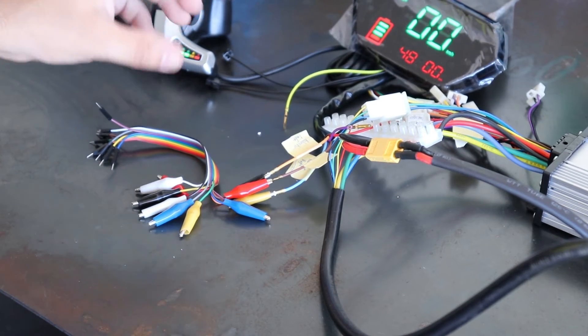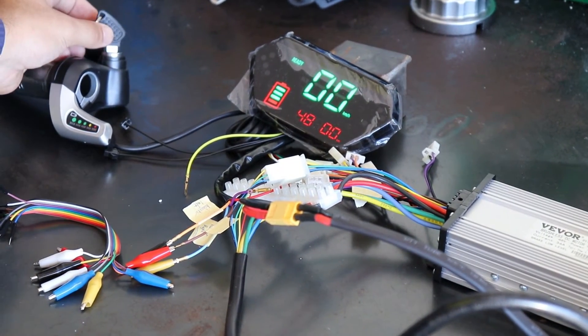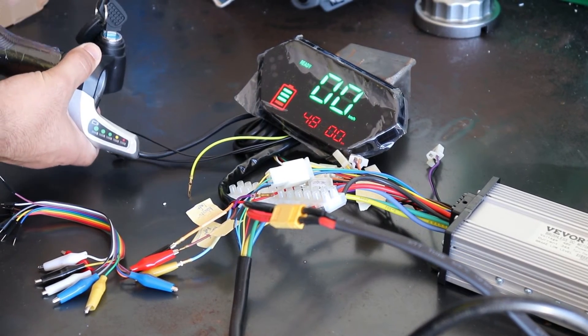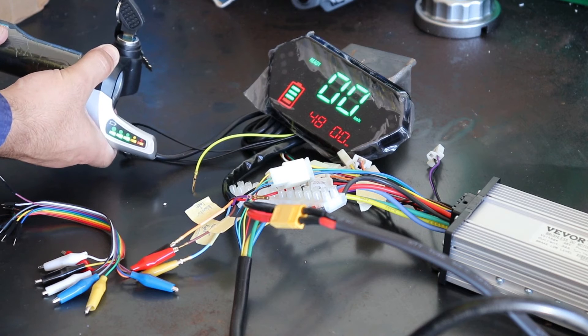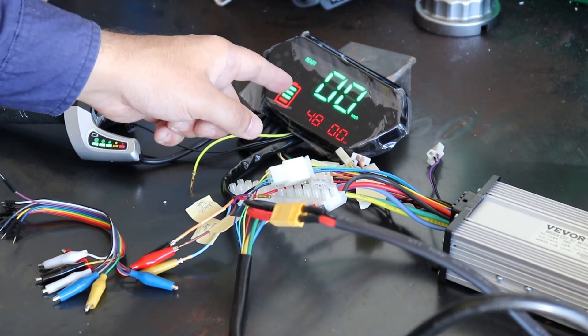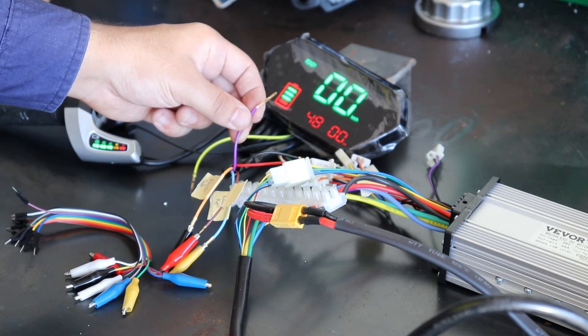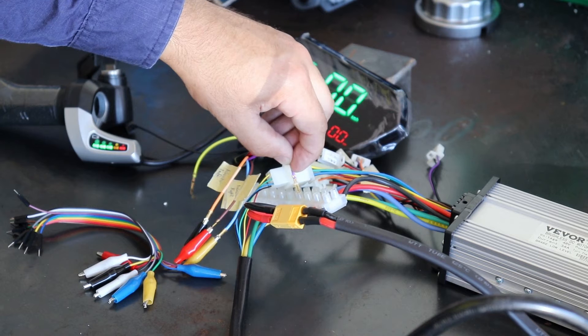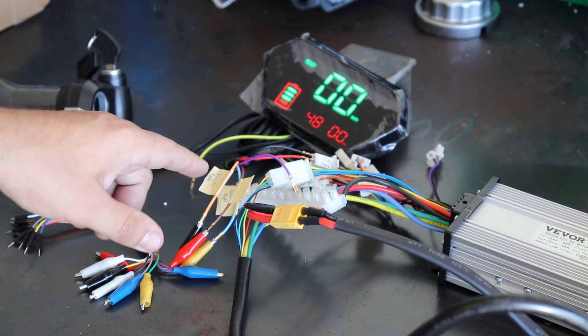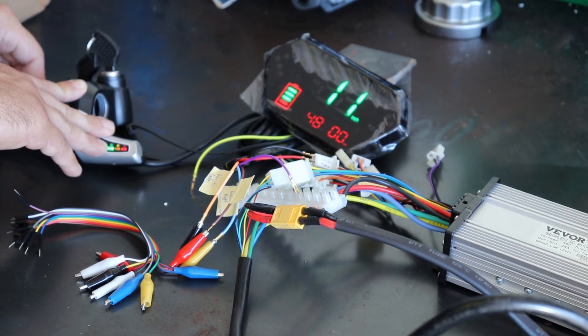Previously what we had: switch on, motor runs. What I didn't know is how to get the speed to display on here. I tried everything I could think of, but I didn't try this. So if you plug this purple wire into the yellow main phase wire here - I'm just going to gently put it in here, just sort of poked it in the top of that terminal strip. Start to drive it - I can now get a speed reading on the display.